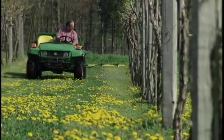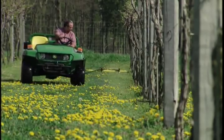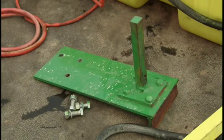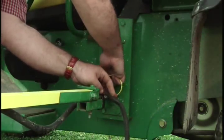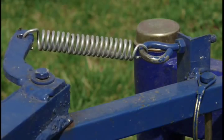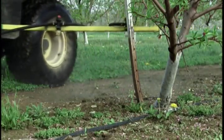The gator we use at UKREC was perfect to be retrofitted as an herbicide sprayer. A plate was built to fit where a canopy was designed to go. The plate holds the spray boom with a quick-release clip. The boom also includes a breakaway spring to return the boom to its original position in case it hits a tree trunk.